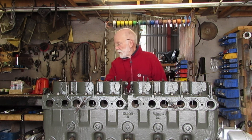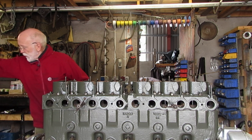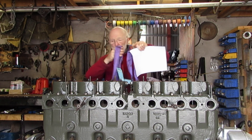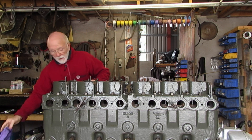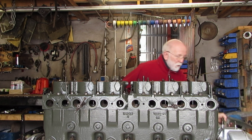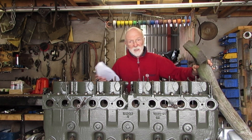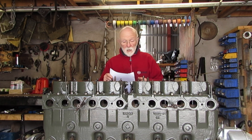The straps we use for the 6LXB are something like these — they are one tonne each, so two straps gives us two tonnes, which is a tonne extra margin to play with. For the 8L3B we would use something like this four-tonne strap. Two of those is eight tonnes, so again we have an adequate margin of safety.